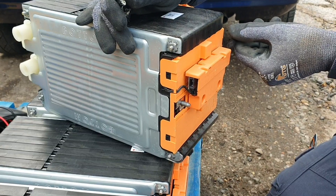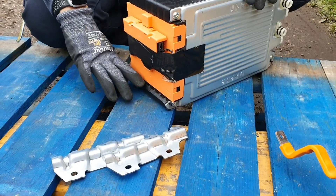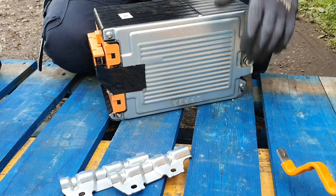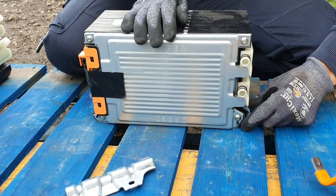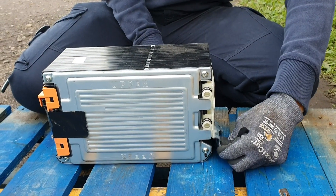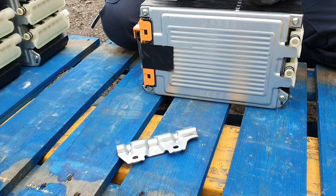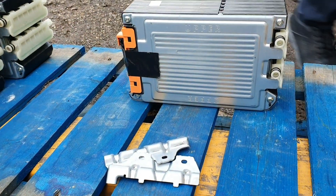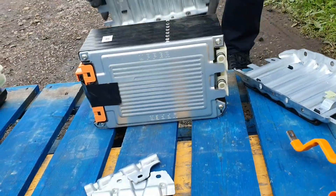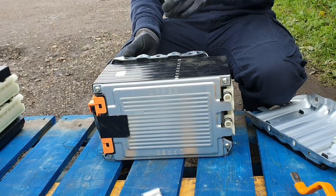The connector running through the modules is a CAN bus signal. To interrogate the CAN bus you'd need someone who can do that for whatever you're building. For mounting, you need a metal bar at the front so the modules clip underneath, and clamps at the back. End clamps go at the sides of the strings to secure them. Les is providing 16 modules plus six end clamps.